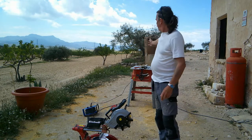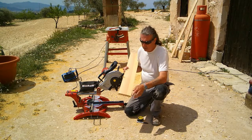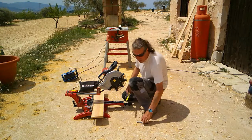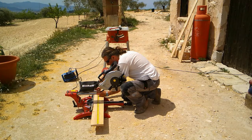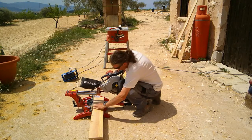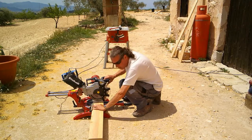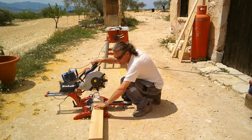So we're in our fabulous outdoor workshop. We've got our tools out — let's get on with it. The first thing we're going to cut are the ledges — the horizontal bits that go on the door. The door is going to be 765mm wide so we're going to cut them to that length. I am wearing my 3M safety sunglasses today. We'll just mark that off at 765mm and make the cut. One down, two to go.